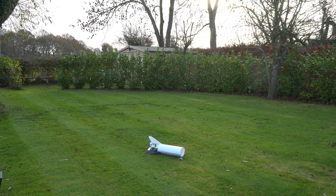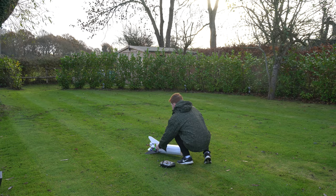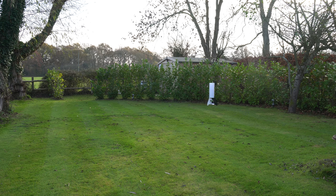At this point I was trying to tune the PID values in the flight controller, but later realised the issue was actually related to the large fins at the bottom. As soon as the craft starts moving sideways or there is a gust of wind, the fins produce more sideways drag than the fuselage tube, therefore tipping the craft into the wind. And because the thrust vectoring isn't strong enough to counteract this, it keeps tilting until it crashes.